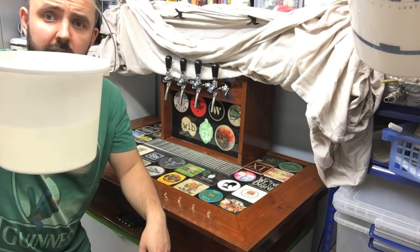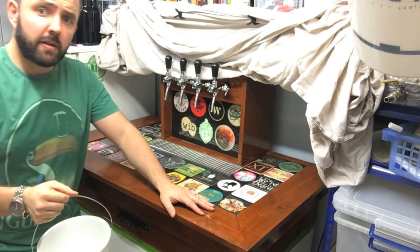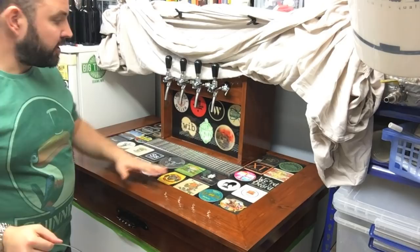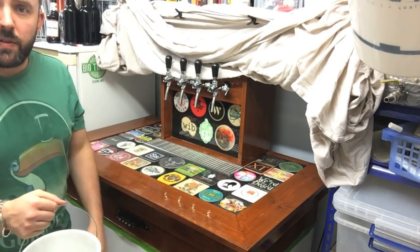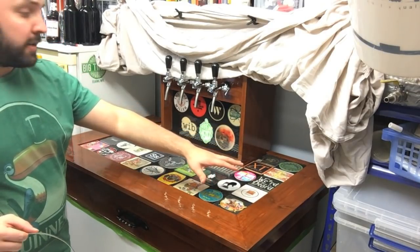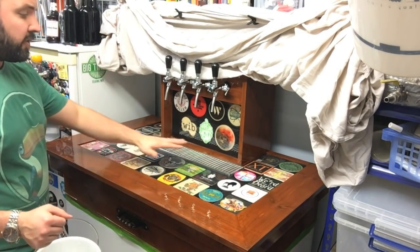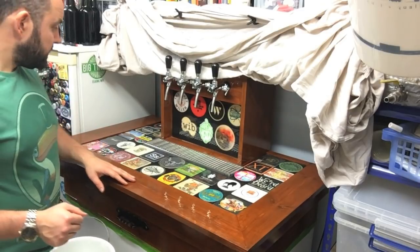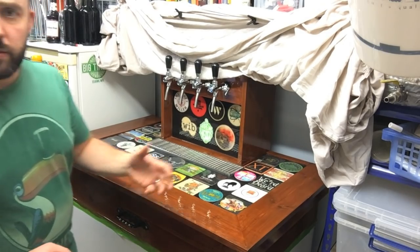It's time for the main pour. In my bucket I've got 1.2 kilos of mixed epoxy, which should give me a depth of about 4 millimeters on the top. I've got a dust sheet set up and cleaned everything off as much as possible to get it as dust-free as I can. I just need to pour it on there, spread it out, and leave it to set. I've made sure to get the table top as level as possible — more so the side panels, because I want it to set level to the bar edging more importantly than the actual inner surface itself.